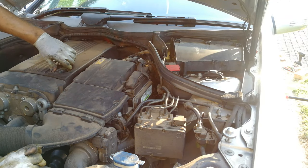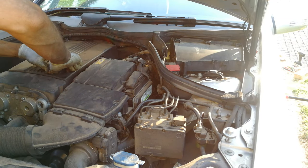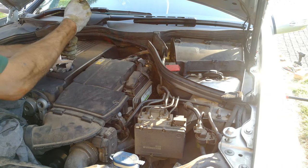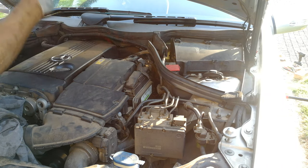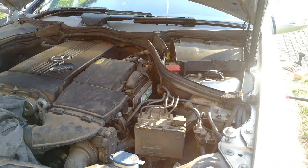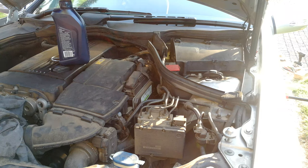Now we're going to have to fill up the oil. I'm going to open the filler cap — this thing should not be very tight. Just use the shifters to loosen it. Okay, so that's ready for topping up. I'm going to get the oils ready, and while I'm doing that I'm going to go underneath the car and put the sump plug in and close up there.